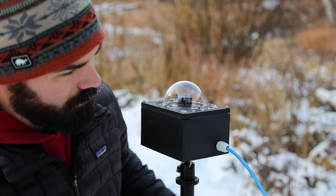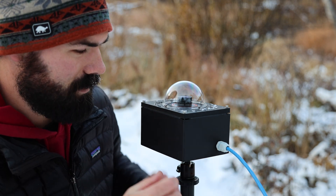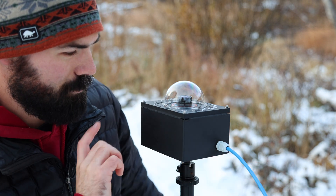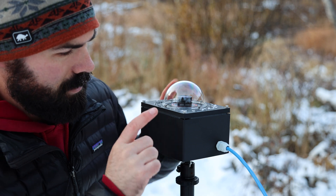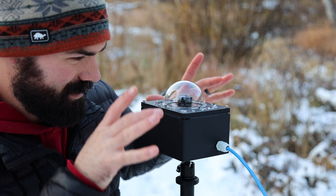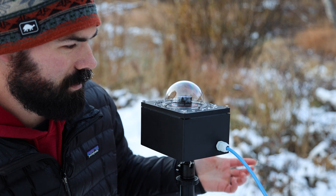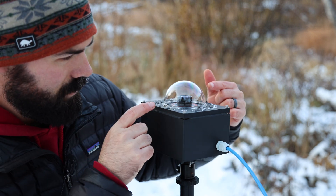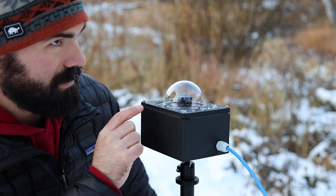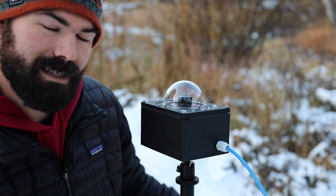From the outside, we've got this waterproof cable gland where the ethernet that's carrying power and data comes in. There's a Raspberry Pi inside. There's a little 3D printed enclosure that I matte black spray painted. There's a gasket that I made with some gasket compound — just squeezed it, let it dry for two or three days, then used a razor to cut it apart. Bolted down a cheap little acrylic dome from Amazon, and then an ASI 678MC is the camera with the default all-sky lens.